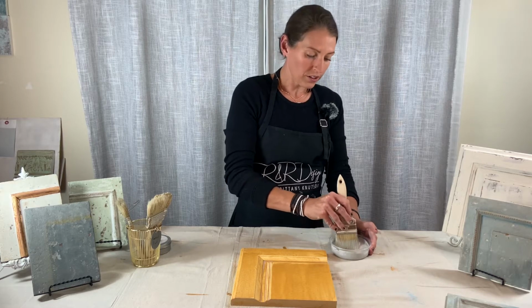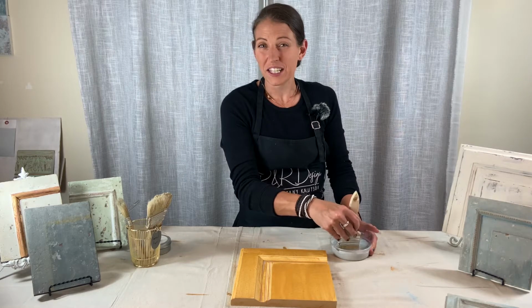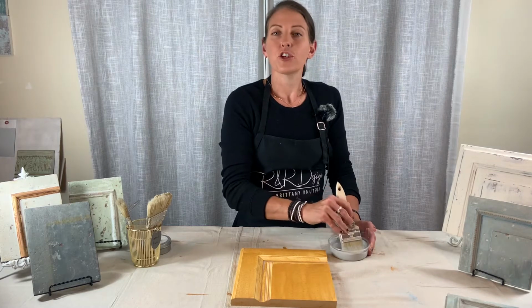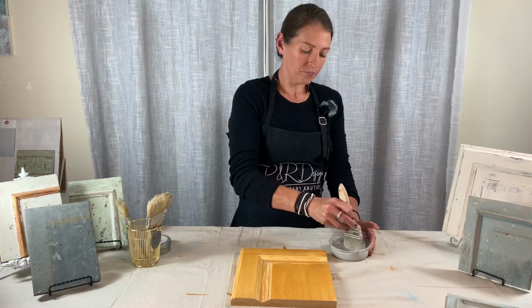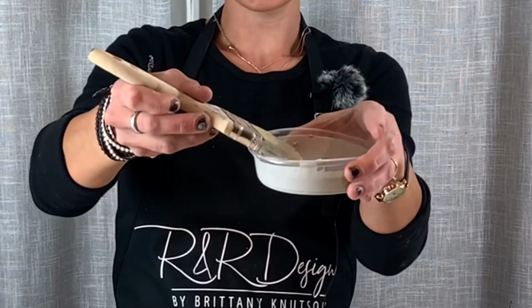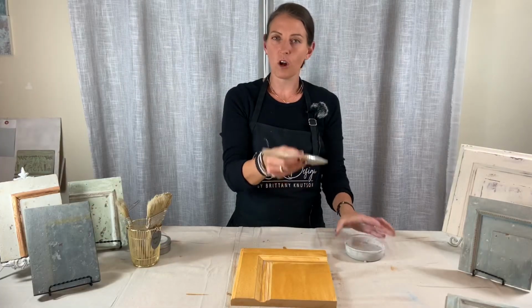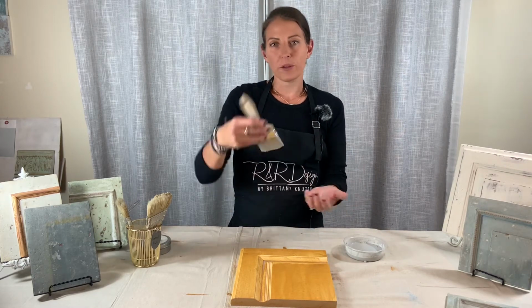This is important. Now, when I put the wax on, you're probably used to letting your wax come to tack. You don't have to wait for the resist method for your wax to come to tack. You can go ahead and paint right after you apply the wax resist. So now that we have this all agitated, we're going to offload, not like we do with normal one-step. We're actually going to scrape just to get most of that water out. And I feel like a lot of people leave a lot of that moisture and water in their brush, and that's why they're having problems with it puddling or dripping when they apply it.